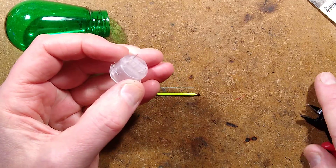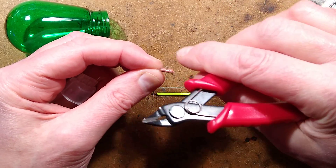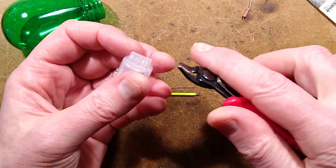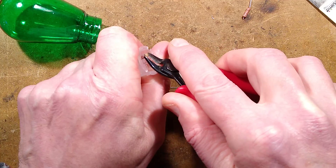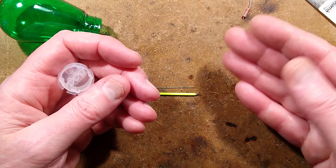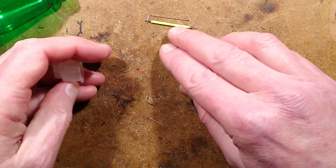I need to turn the soldering iron around because I'm going to need that in a moment. Here is mystery resistor number one - it has no markings on it, a very low resistance. You can see where the laser cut the spiral around it but it's being used just as a generic link, which is quite strange. They could have used two resistors to reduce dissipation and increase the power, but they didn't. The resistors they've used seem to be half-watt-ish. Brown, green, orange: 1.5 and 3.0 - 15K.